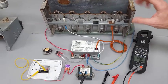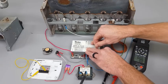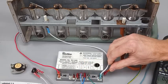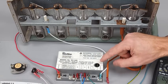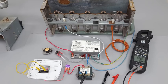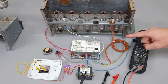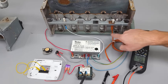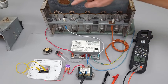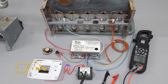As for the spark wire, come in close and look at the spark — it should be occurring right at the spark rod. Watch what happens when I pull this wire out: you still hear sparking but it's happening internally inside the module, not at the spark rods, and that's not going to ignite the flame. What was also happening is that after the internal sparking, the gas was actually coming out of the orifices — the gas valve was powered — but because no flame was proven with the flame rod and GND, it stopped power to the valve and to the spark rod.